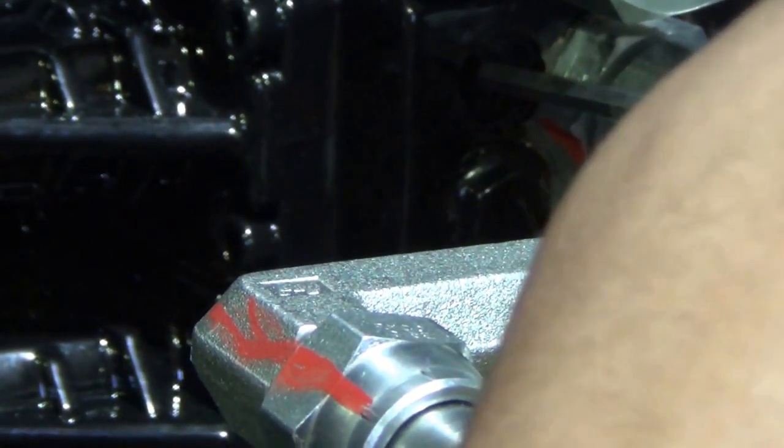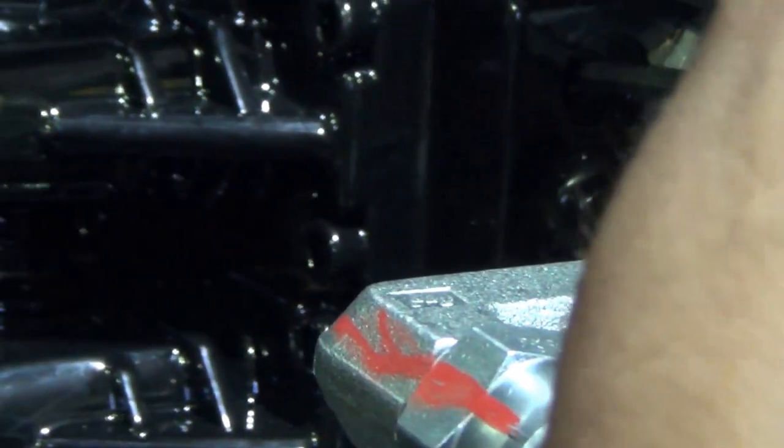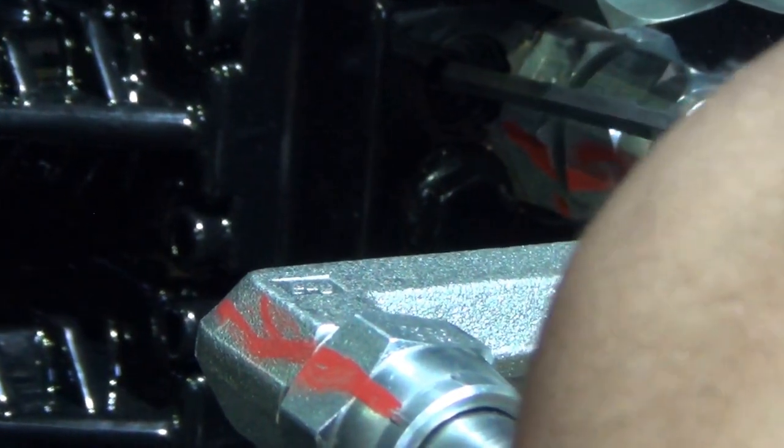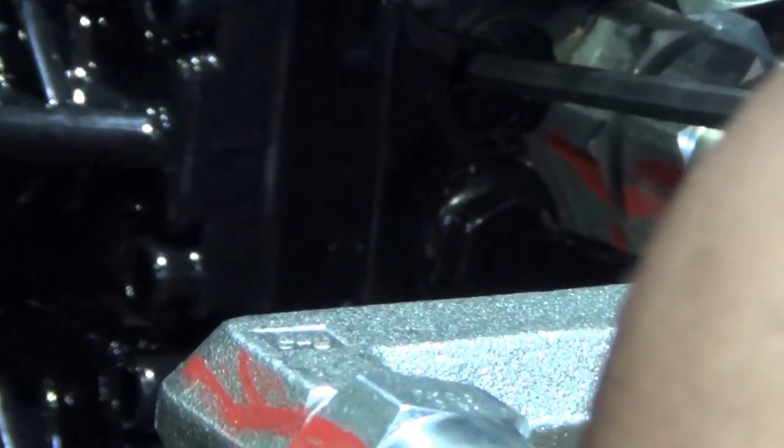What we're looking for on our scraper wings coming in is going to be 1,900 PSI. We're trying to pull that heavy material in, so we want a little bit more pressure there to do that work. But we don't want an excessive amount where we're always trying to pull things through each other.